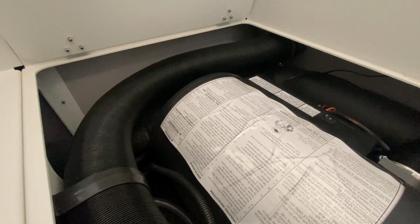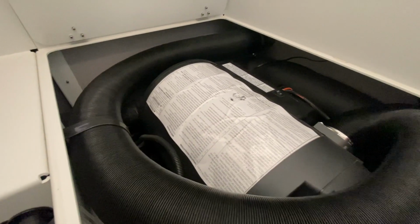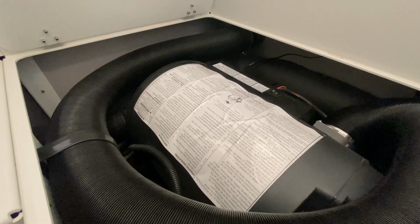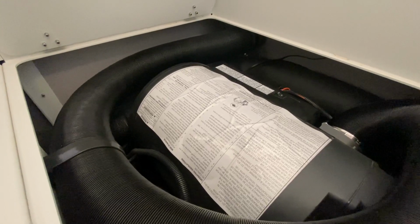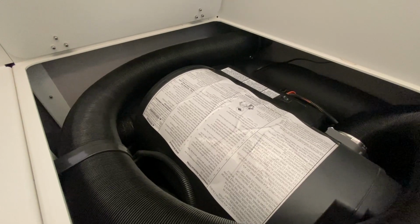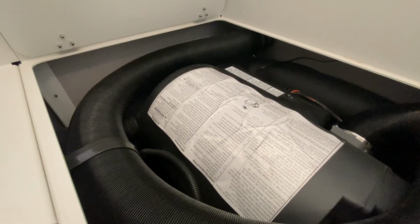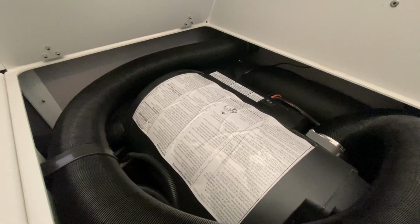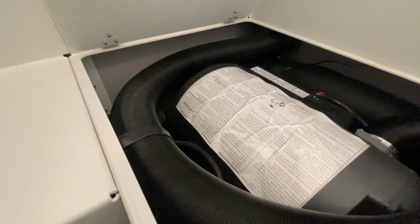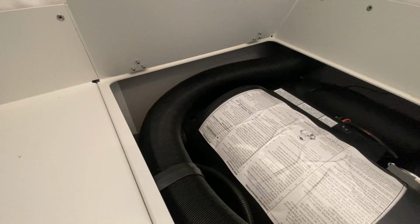And because of the 14,300 BTU output, this furnace is more than adequate for this space. During testing, these campers have been to 10 below 0 Fahrenheit with full comfort and full functional water systems. And how that's achieved is that we do duct heat into the underbelly, or the space below the floor where the holding tanks and some of the water lines are.